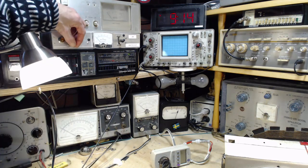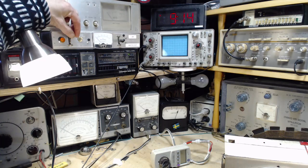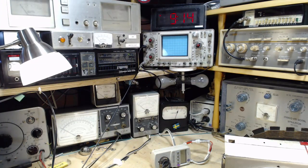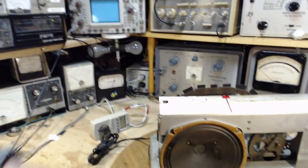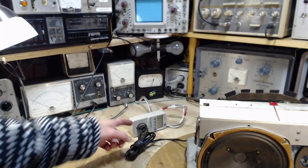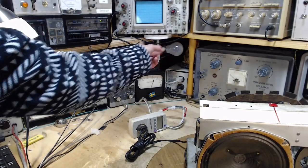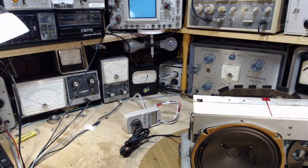So we're going to start up with using the lights here. So that energizes the system, so to speak. That's a main power switch, and this is a selector. Down means through the lights, up means straight through, no lights. Now what happens is, if there's a big short in here for some reason, something stupid, maybe even a short right in the plug here that I didn't spot, when I turn the power on, all that will happen is one or two of the lights will come on full tilt, and I'll certainly know something has gone wrong.